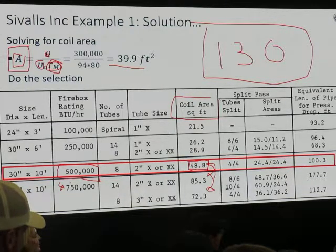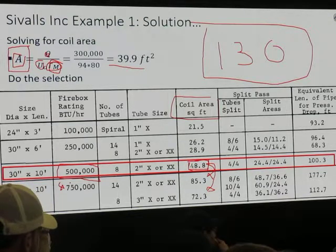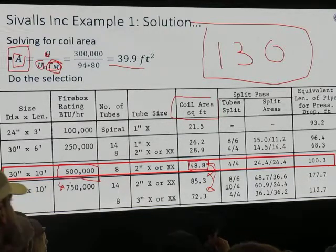If you think we can heat it up a little bit more to compensate for that BTU per hour, that's wrong. Look, we produced that 5 bars. Doesn't matter what temperature you make, we have just that much BTU coming out per hour. That 5 bars has the rating of that BTU per hour. That's the amount of heat that it generates, no matter what temperature of water you want.